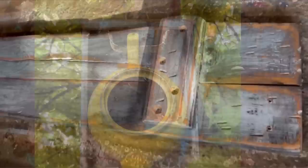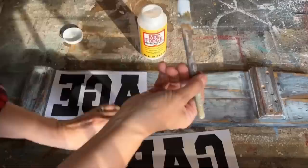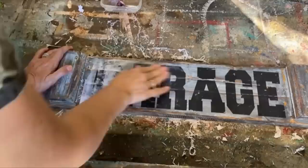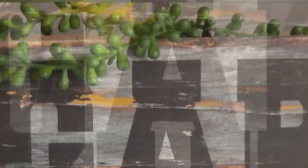I had this piece of wood left over from another project. I'm going to turn it into a really fun sign — I've painted it, distressed it, and I'm going to turn it into a garage sign. It's going to be a perfect gift for a dad or a grandpa or uncle. I printed off these graphics on my laserjet printer making sure to reverse the text and I'm using my Mod Podge matte. Let it sit for 24 hours, then dampened it with a rag and a little bit of water and rubbed off all the paper, leaving these graphics on the sign. I'm going to seal it up with some polyacrylic sealer. That's how easy you can turn a scrap piece of wood into a great sign — it's going to make a great gift.